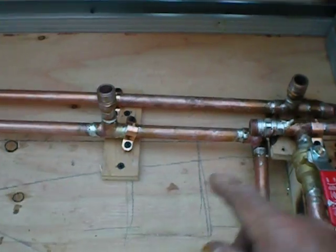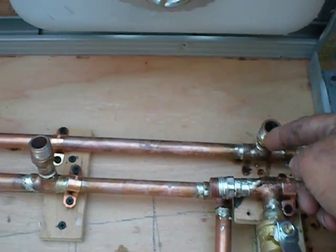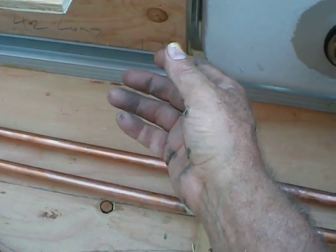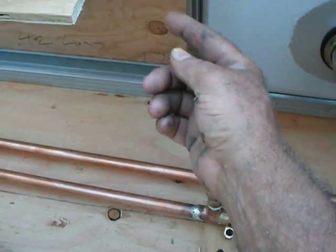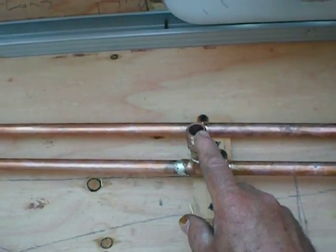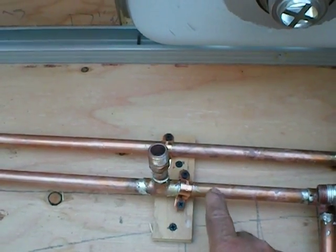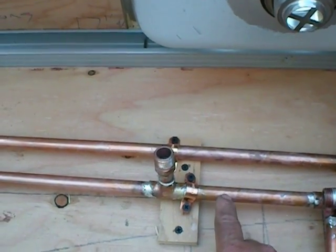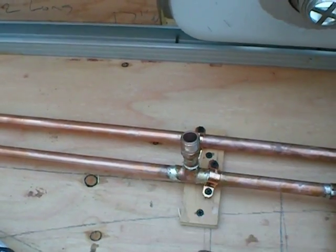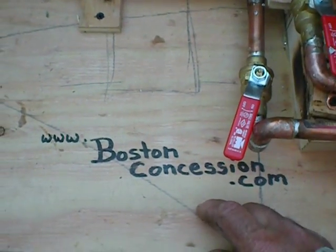So you have water from your pump coming into a line and feeding each sink, then the instant hot water heater, then comes back from the instant hot water heater in a hot line feeding the sinks. This is important. If you use instant hot water and you are trying to run plumbing in soft line, you are going to melt the line.